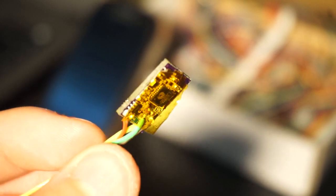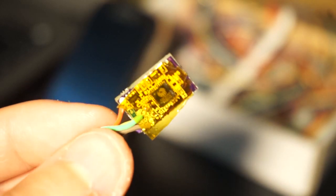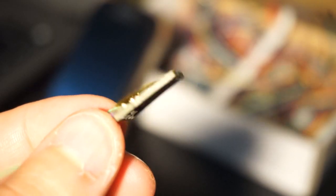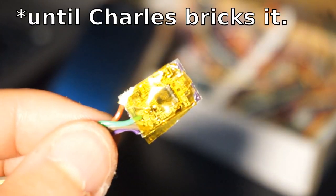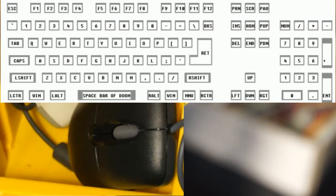Or more importantly, we did. This here is an ESP8285 board. ESP8285 is basically just an ESP8266 with the flash built in. This board right here has an ESP8285 on it, along with some minimal complement of components and a bunch of programming wires. These don't actually need to be here — they can all be desoldered. And this emulates a mouse and keyboard.